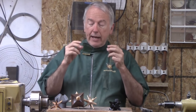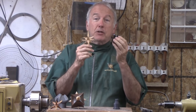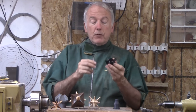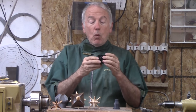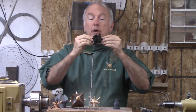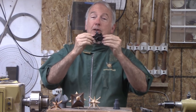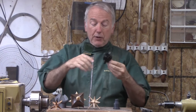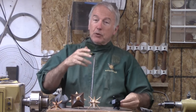And then I had another stray thought. Can I take a cube just like this one? In fact, these started off as being cut as cubes the same way. But instead of drilling holes for a pen mandrel, why not turn it on the points? So you turn this way to get one, put it on another set of points, turn it and get one, another set of points, turn — and there are actually four axes on this one as opposed to three on these.